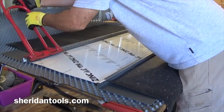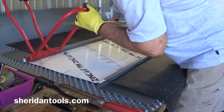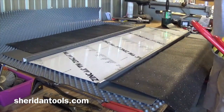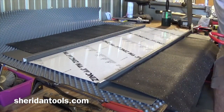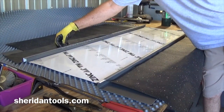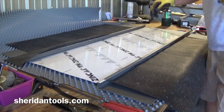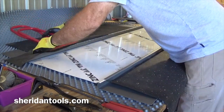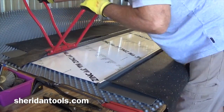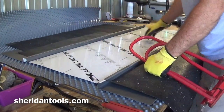Single stage. And again, if these tools are clean, you shouldn't get a tool mark here from the seamer. If it is marking the seam, just go back to a piece of rubber, put a piece of EPDM on the seam. Okay. And you can take that tool, lock that like that, okay, and eliminate those tool marks.